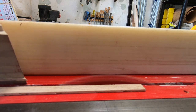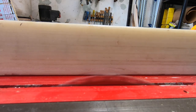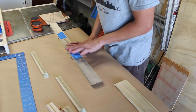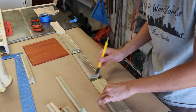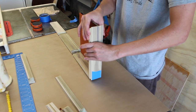After the glue dried on the inlay, I trimmed the red oak down on the table saw as close to flush as I could before sanding. To assemble the lid and base I went ahead with the blue tape method for miters — first you tape the outsides together, flip them over, apply glue, apply your panel, and then roll up to assemble using a last piece of blue tape and some glue to lock it into place.